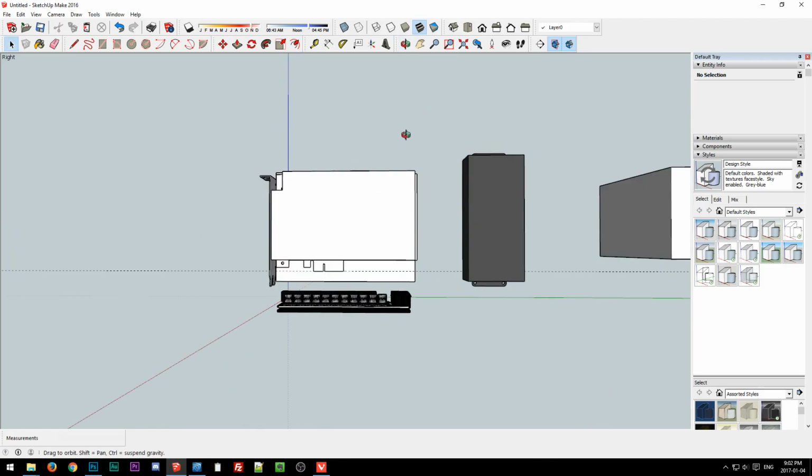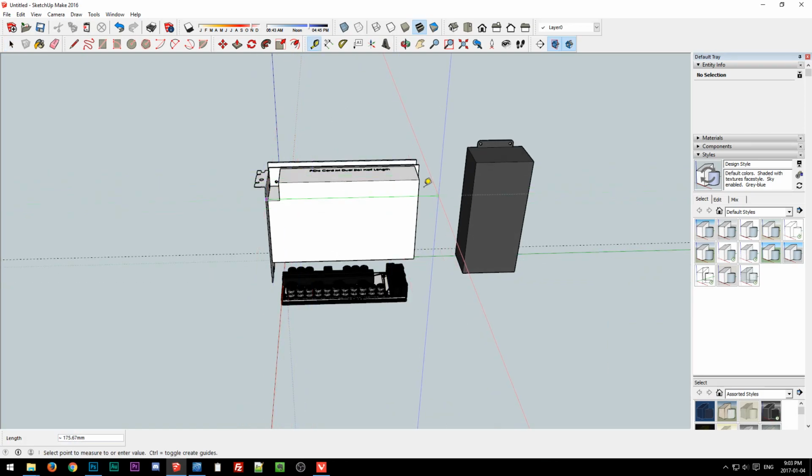Well, no, I guess, because it looks like there's a lot of wasted space if you have a short card, but you have to keep in mind that cards that are actually this short, like 150 to 170 millimeters, would be pretty rare. That would be something like the Nano or some of the 1050s. Then again, a 1050 would be a weird card to use for an external GPU dock because it's not very powerful. To me, one of the big things with the GPU dock is that you could have a fairly beefy card and an Ultrabook, for instance, that has a good CPU but really no graphics horsepower. And then when you're home and you want to play games and you're not running off battery, you could plug it all in.